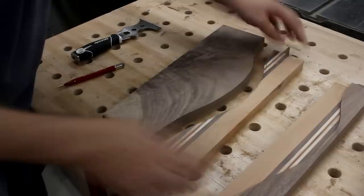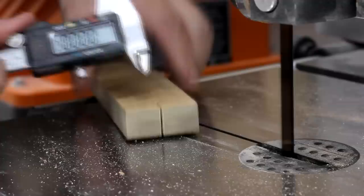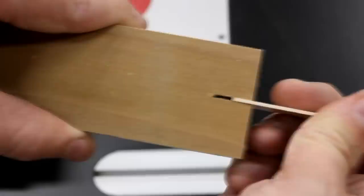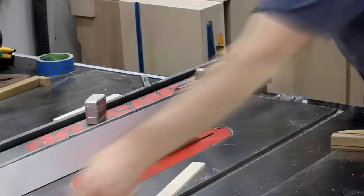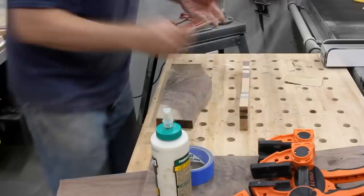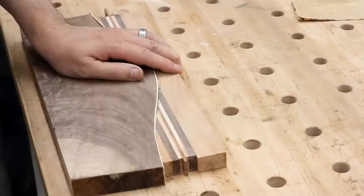At this point they fit together but not perfectly. I need to fill the gap between them with a thin strip of wood that is the same width as the kerf on the bandsaw. So I make a quick cut and measure what the thickness needs to be. Then I grab my thin strip jig and dial it in until I'm cutting strips that fit into the kerf perfectly, and crank out a whole bunch of them for the rest of the project. I give both pieces a light sanding to mitigate the bandsaw blade marks and help ensure a good tight glue joint — just softening any real rough patches, careful not to alter the shape of the curve. I squirt on a couple lines of glue, drop in one of the thin strips, and clamp it up tightly to dry.